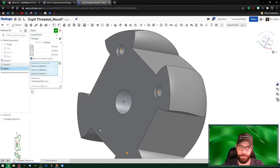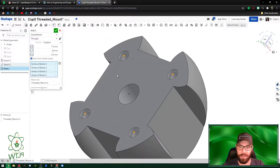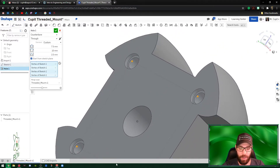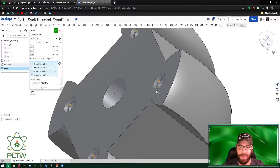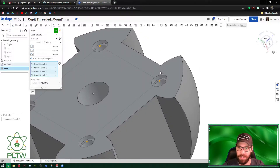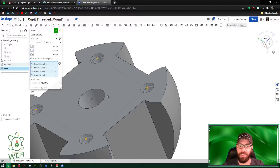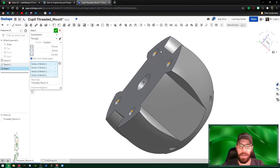Select the four points where you want the center of the holes to be. The measurements match what's in the walkthrough: 7.5 millimeters across the gap, 10 millimeters for the large opening gap, and 2.5 millimeters deep for the bolt head to drop in. Once the bolt is inserted it'll be completely flush — nothing will snag — making it much easier for whoever uses the product.